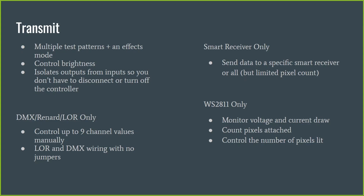It isolates the inputs and outputs, so you can plug it into a controller that's outputting data and it will ignore the incoming data and drive the output instead — no need to turn your controller off or do anything unusual to prevent interference. In DMX or serial mode, you can control nine channels with very specific values. If you're working with a moving head and want to send particular values to particular channels, you can set the F-Test up using the battery, plug it into your device, set the channel values, and check your moving head is doing what you expect. It outputs both the LOR and DMX wiring patterns simultaneously without any configuration. For Renard, you will need to use the adapter.